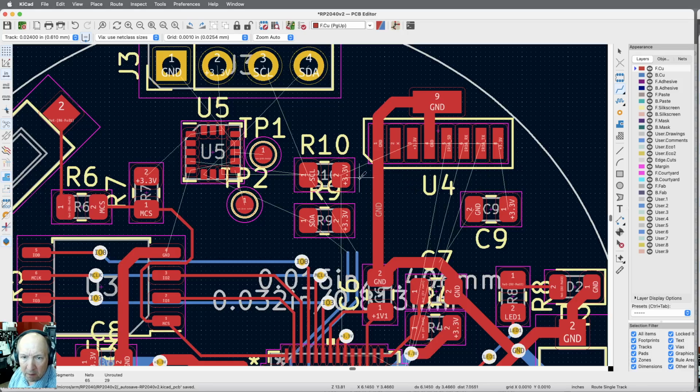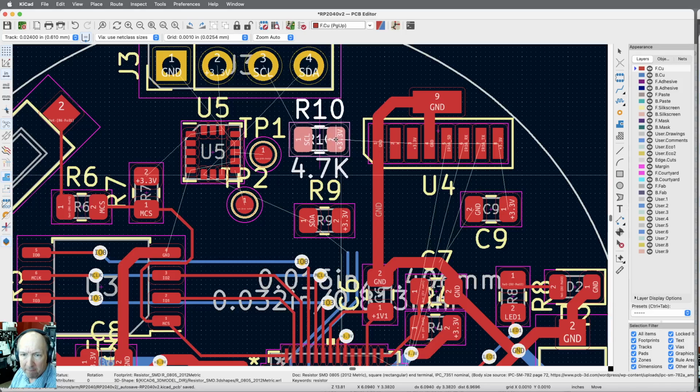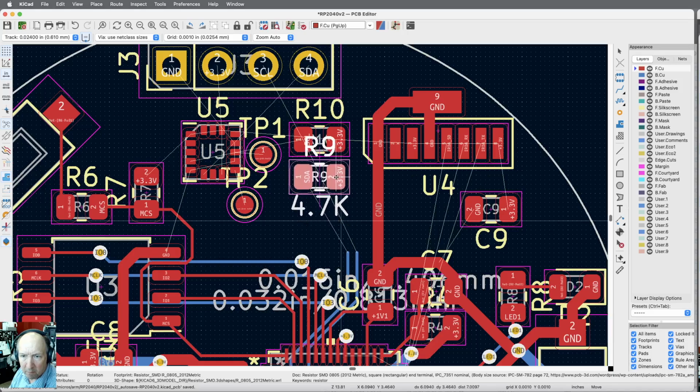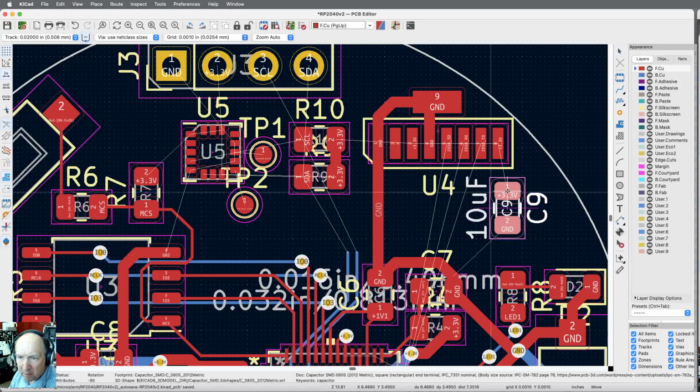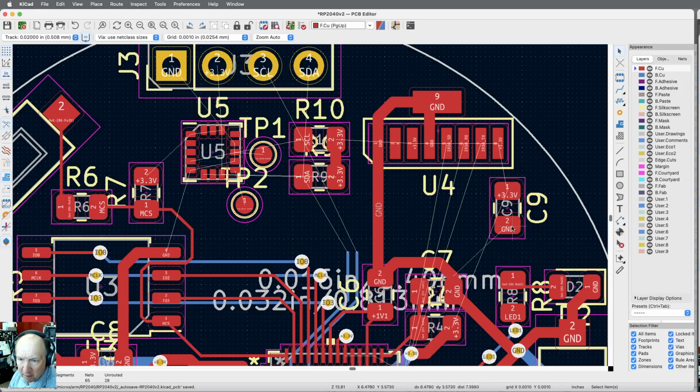3.3 volt. Again, we're going to have to jump back and forth just a little bit. I can move these parts. They don't need to be right there. Let me move them up a little bit. So we're still on a big trace, so I can say I want to run a trace from there to there. I can't quite stay that big, I don't think. Let's go down just a notch. This guy's going to have to move a little bit. Let me just rotate him just to make him a little easier to put where I want, because I'm going to need vias in here. Here's a ground leg. This 5 volts is, here's my 3.3 that comes up. So we can bring that up as blue already. Blue. I'm just going to leave it at the 20 mils.